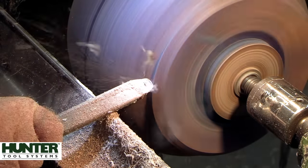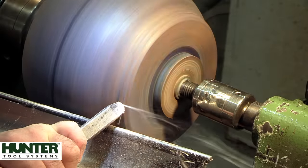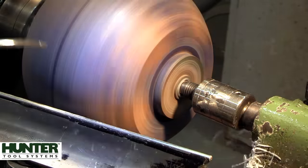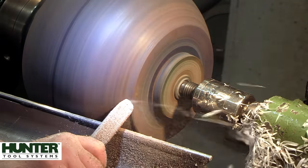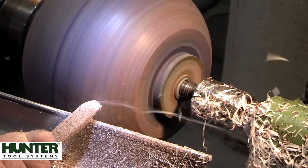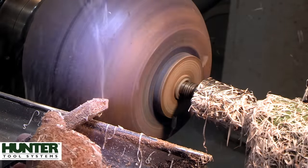So speaking of densities, there were some people that wanted me to cover basically wood densities, and I prefer to work with woods that have higher densities than, say, woods like birch, soft maple. Soft maple is actually quite nice to work with, but birch and poplar, those types of species, are easy to cut, but it's hard to cut cleanly. You have to have really sharp tools when you're working with really soft woods, and that's just to prevent all the tear that maybe you're going to get.